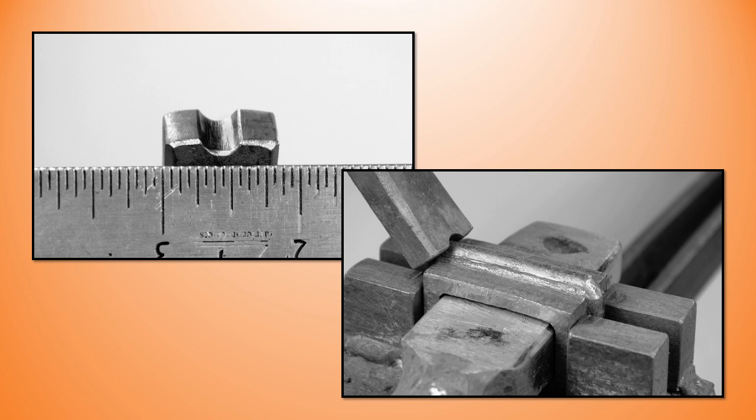You can do a hand tool variation if you don't want to make a set hammer. This is something I use when I do the forged collar to create these nice corners here. And this particular one was made from a 7.5 inch length of 3/4 inch round 4140. But I digress. Let's get back to the collar.